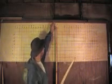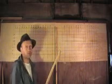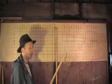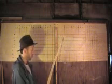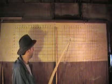Usually there's a clamp. I use blocks to secure the bow in there, and then we'll be flexing it to see how the limbs bend and if they bend in unison and where they bend, and therefore we will know if we need to remove material from any given part of the limb so that we can get a uniform bend in the limb.